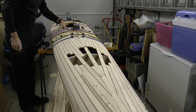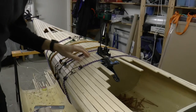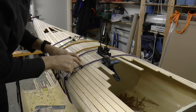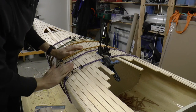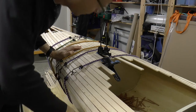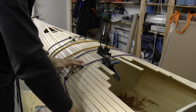As you don't staple the strips to the hull, you can also get waviness. And that is something I have got here — you can see that this area is a bit low. So probably I didn't face this one correctly, or I put too much pressure higher up, so it's a bit wavy, especially around this area. I'm not quite happy with that. I'm not sure if I'm going to do something about it. Of course I will sand and it will get better, but maybe it's not possible to sand enough to get rid of all the unevenness.